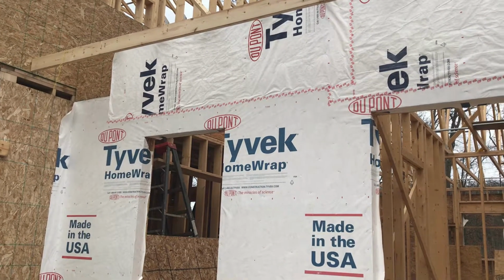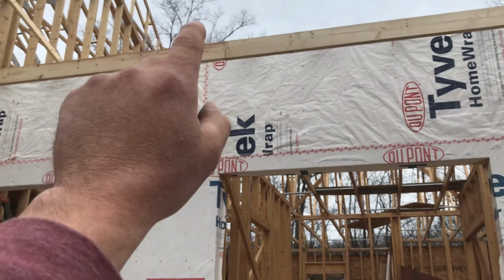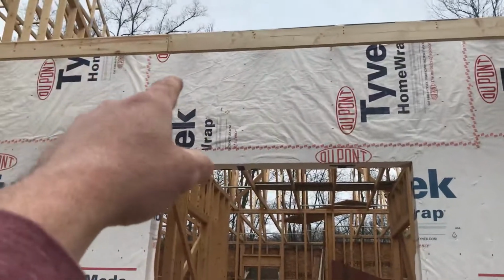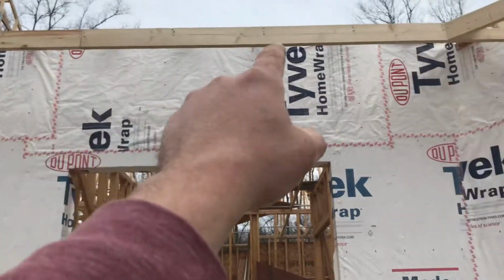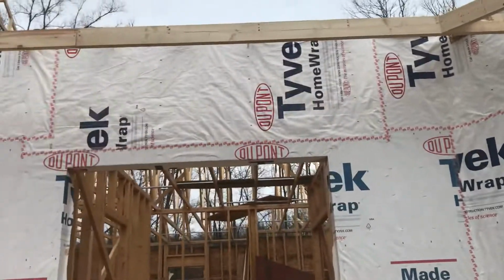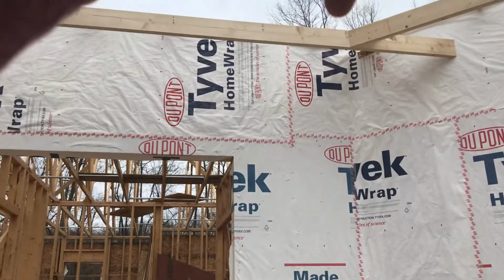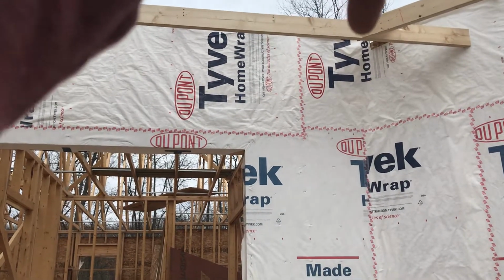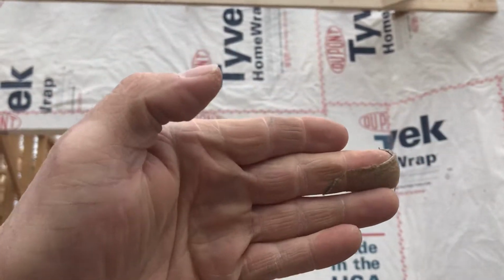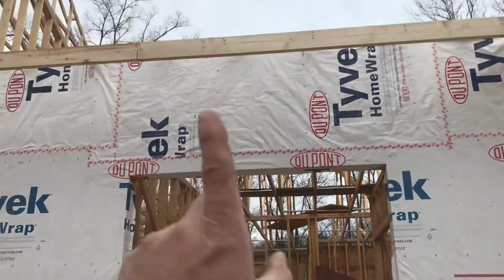We shoot one nail, and then we come over here, shoot one nail too, but leave it a little bit lower than plane, and usually just tack it, let the nail head stick out, and then put your nut right here. It breaks right here, so we just put another nail there, and then plane that one perfect. And then what we do is we set a dry line, and we nail it to where the nail is driven on the front diagonal. And what that does is when you string that, you can check for up and down and in and out at the same time. Because you know, your board's naturally crown, you always want to put your crown up.